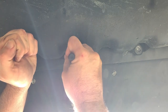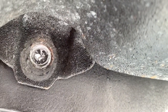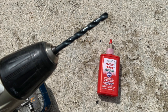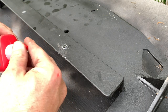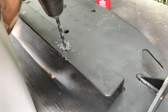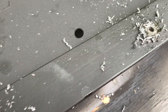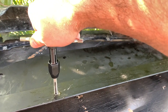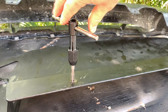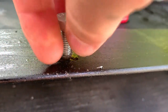I use a screwdriver to scrape and mark the spots where I need to drill. To tap the holes I got a drill kit from Amazon and some tap magic to lubricate the drill. Go nice and slow, hold the drill as evenly as you can. Using a half-inch tap holder set, slowly twist the tap, go back a quarter turn, keep turning, go back a quarter turn, clear it out, and make sure it's nice and clean. Do that for all three holes, then test that the bolts are going in nice.